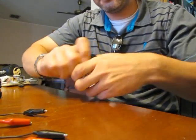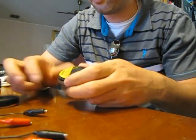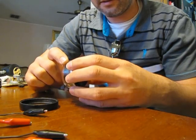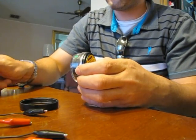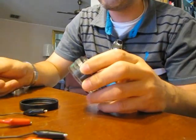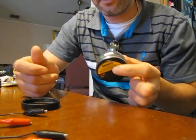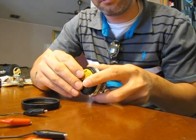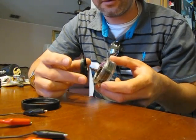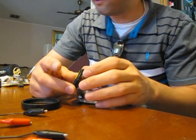What I'm going to do is unscrew this. Pretty simple. I don't put them on super duper tight, but if it's from the factory it will be super duper tight, so you need one of these — the old strap wrench works great. Take your fingernail and just pop it open. Be real careful because there is that little band in there and you can break that, and that's no good.